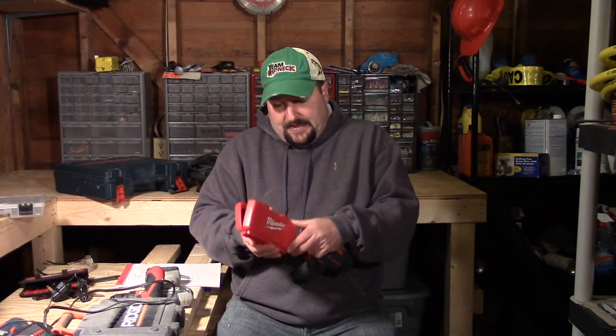I'd recommend getting yourself a bit set. I picked this one up at Home Depot — it's a Milwaukee bit set. You don't need 50 million bits; a small bit set works great, and you can buy cheaper sets that work fine too. But a set with 42 bits for $15 isn't necessarily better than 15 bits for $20 — cheaper bits are made with lower-grade material and don't hold their cutting edges as well. Some are designed just for wood, while higher-end ones handle wood, plastics, and metals. If you want an all-around bit, look for a little higher end and something designed to cut all three materials.